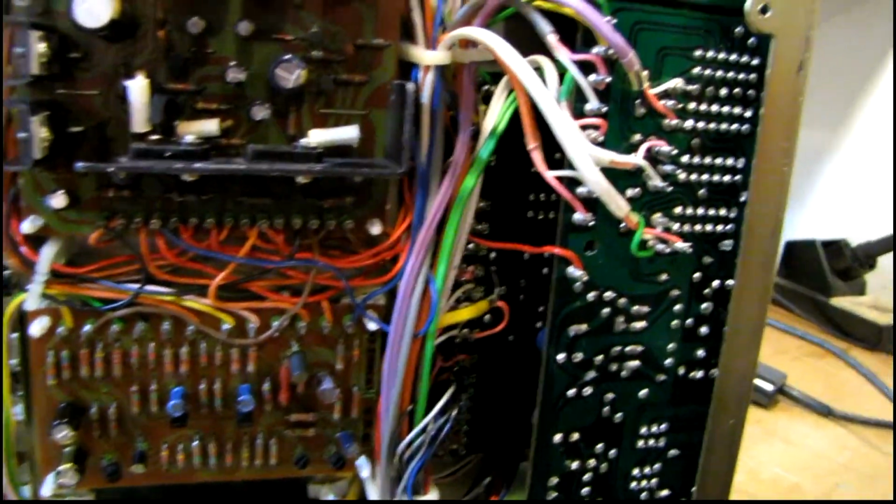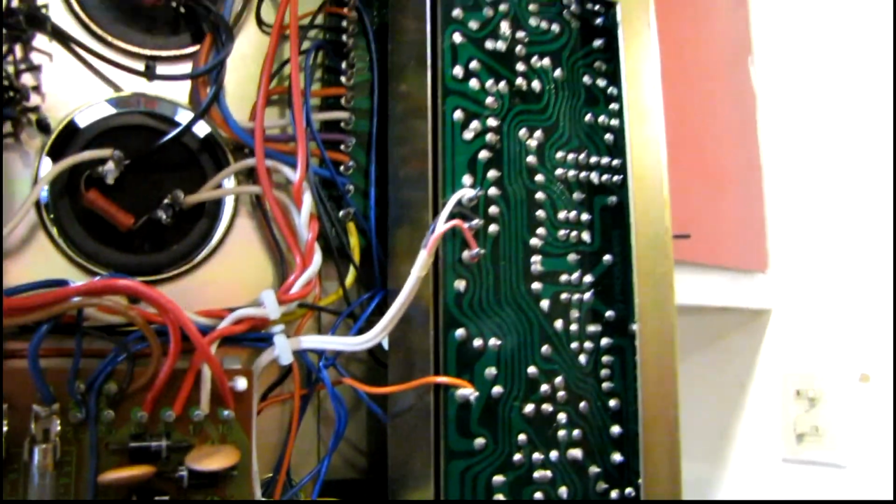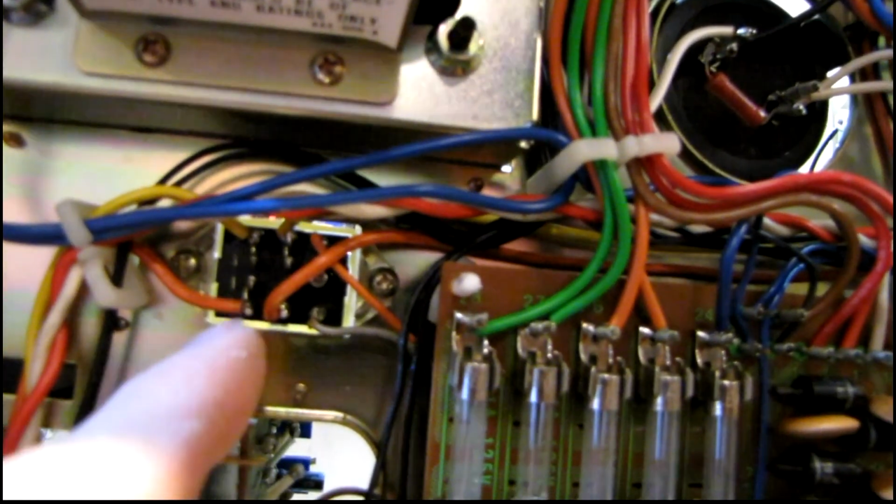I've got the preamp boards back in now, all new caps and cleaned all the controls that were giving me problems. And discovered another issue while I was tucking the power supply wires back into their holders while I had this playing at a low volume. When I moved these by accident while putting these back, it caused one channel or the other to either change in volume or cut out altogether, and that tells me that the relay contacts are getting flaky. So out comes the speaker relay.